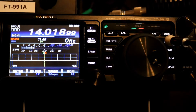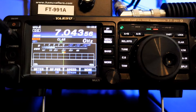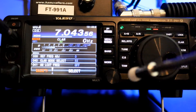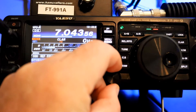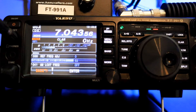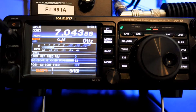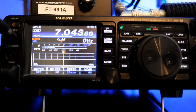I'm going to key my radio and keep an eye on what happens. You can see that my transmit frequency is going back to where it was — that's how the received clarifier works. Reset it by pressing and holding the CLAR button, and turn it off by just pressing it. The green RX indicator goes away. Now let's go to the menu, select RX, and change it to TX. Whereas the RX only changes the received frequency, the TX only changes the transmit frequency.